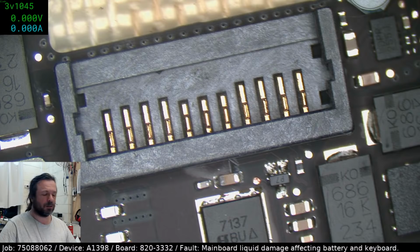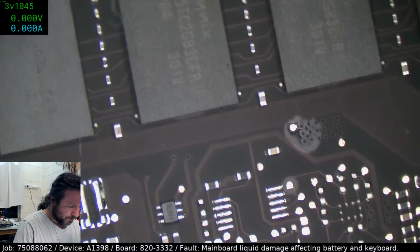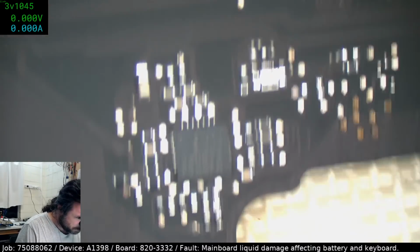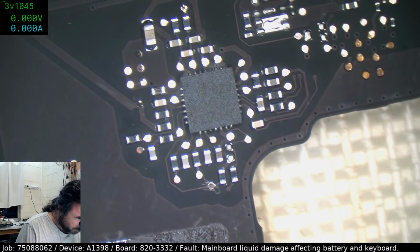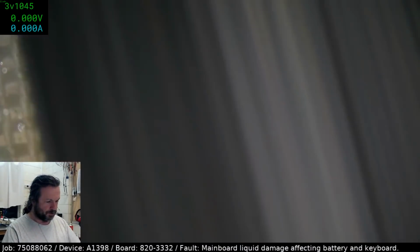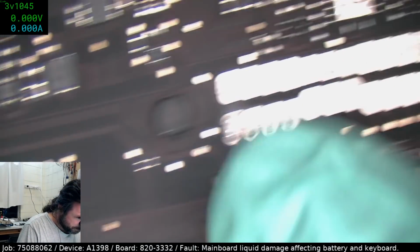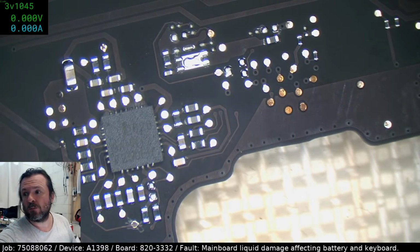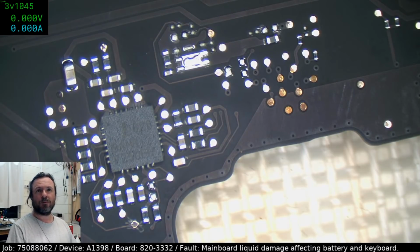I'm pretty sure it's not the ISL. I mean, it could be. I'm pretty sure the ISL was also replaced, but okay. So we'll check the continuity between the ISL and the battery. See if we've got the I2C lines running okay there. Yeah, the cap does. I agree. That's C6960. And was that PPBAT G3 hot connection?